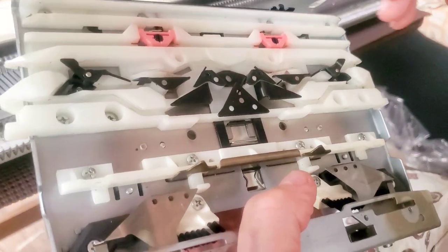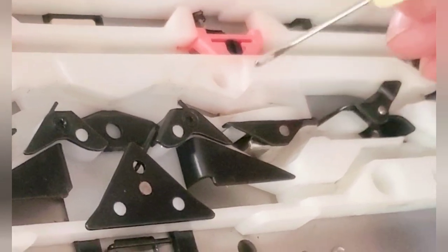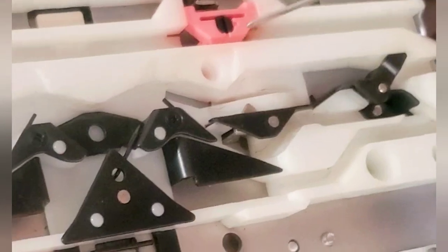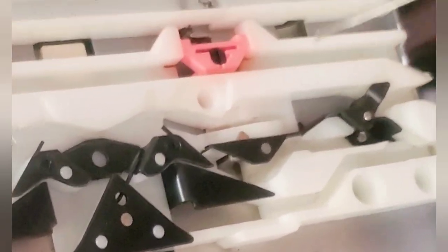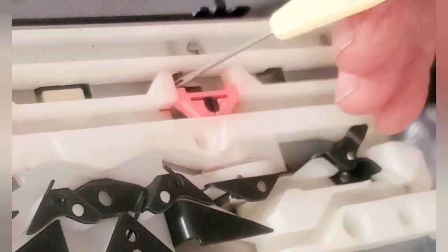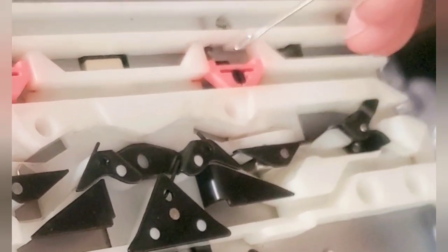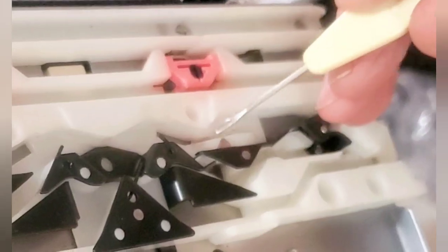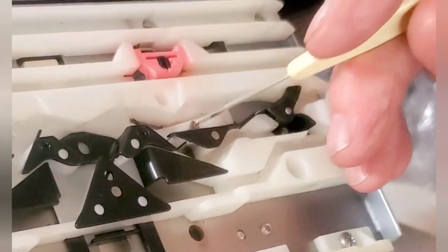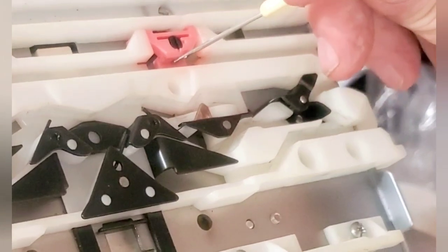So what would make it quite stiff? We're not there and can't be sure, but this slide moves because there's a plate in there, and it has to move freely in order for this to come up. So if there's crud underneath there — crud here or here, old grease — this metal piece runs all the way underneath here, and it's actually the end of this piece, this cam that comes up. This is a directional cam for the needles to follow.